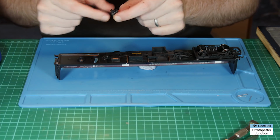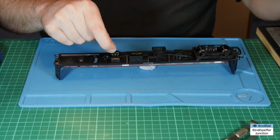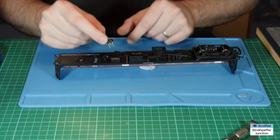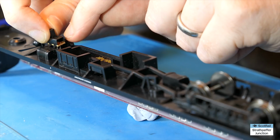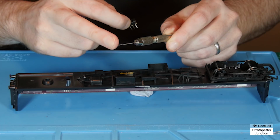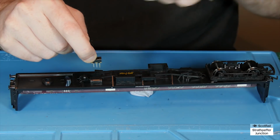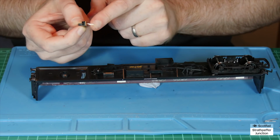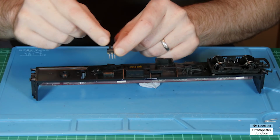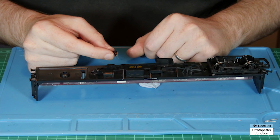The way that I like to do this is just to line up where we want it, and then I use my permanent marker pen just to mark where each of the legs are, and then I get my pin vise and a little drill, and I drill 3 little holes so I can sit those legs in. Once I've sat those legs in, I'll apply a little bit of super glue to the underneath, slide it in, and then that is the switch stuck in place. Then we can turn everything over and do the wiring from the inside.